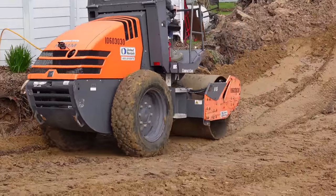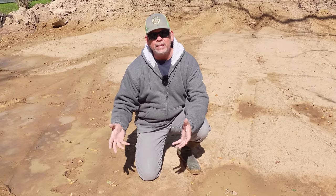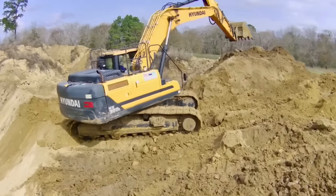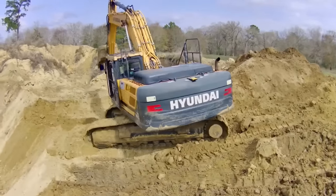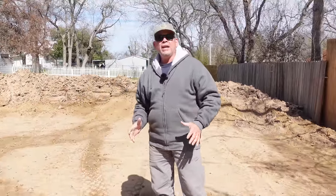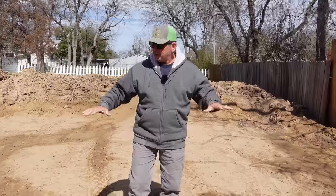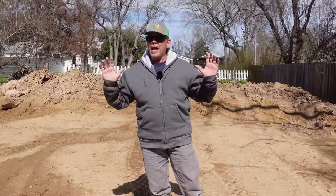Select fill is 60% clay and 40% sand. It doesn't come out of the pit already mixed — the excavator operator digs some clay, digs some sand, and mixes it in that 60-40 ratio while waiting on trucks, then stockpiles it. Our stockpile was tested by the soil engineer before we brought it on site, and we are good to go. This is gonna hold up this garage forever.